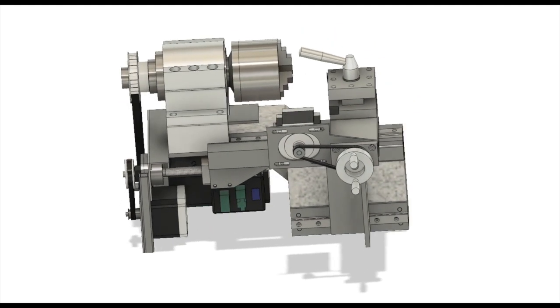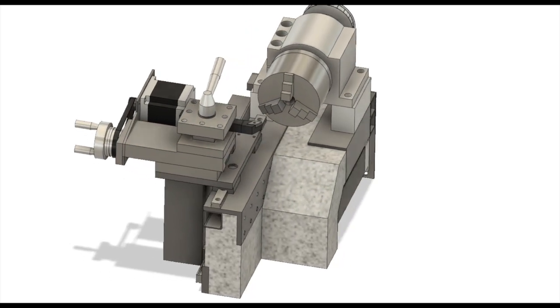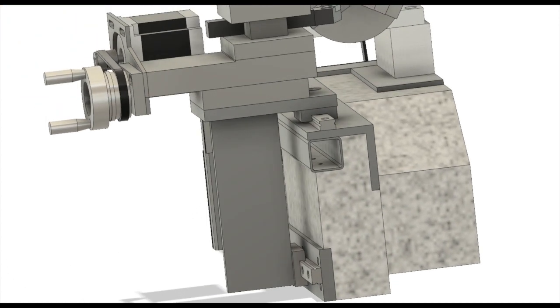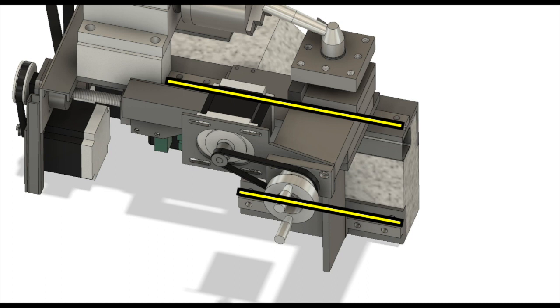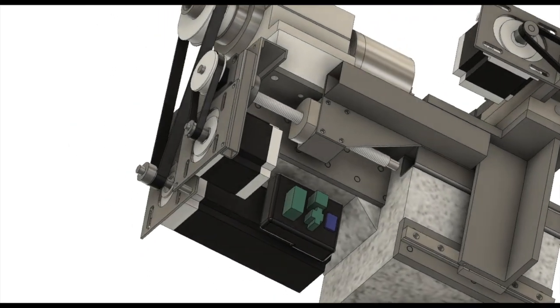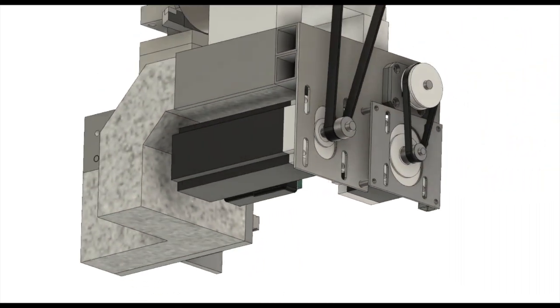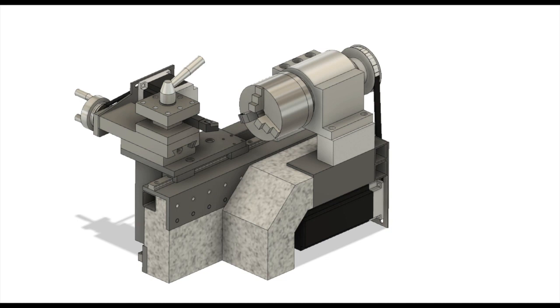This is the CNC lathe I designed. I went through many design changes to design a cool machine that would motivate me. I think this design is quite unique. Two Z-axis linear guides are mounted at a 90 degree angle. The two linear guides on the Z-axis are different lengths, and only three linear blocks are used. This design makes it possible to make a smaller machine, and space for the motor to be placed under the headstock. It makes possible smooth discharge of cutting chips.